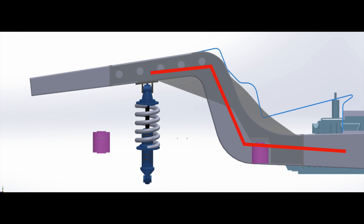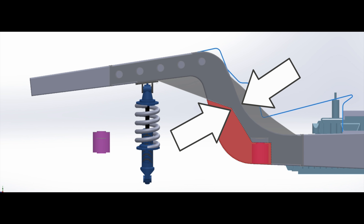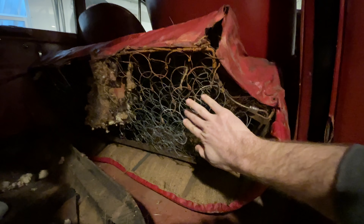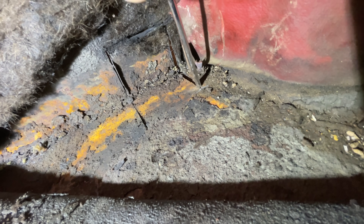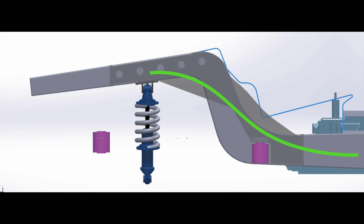The frame was originally doing this S-curve thing to go up and over the rear axle. I needed to cut out all this area, which would make this area super weak. There wasn't a lot of space to reinforce the frame here because the rear seat pan is right in the way, but also the rear seat is getting replaced. It's also eight times thicker than it needs to be, so I just cut some holes in the bottom of the body under the seat and put my reinforcements where they needed to be. The new frame design has a much straighter load path — it's probably a better design this way. I didn't do any computer analysis to confirm this, but neither did Jaguar.